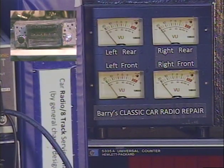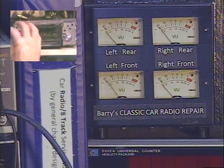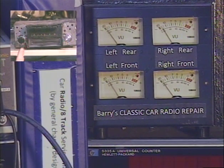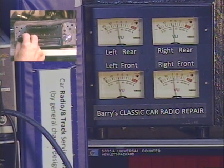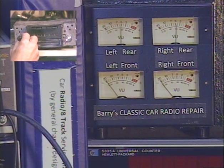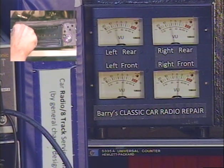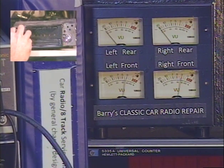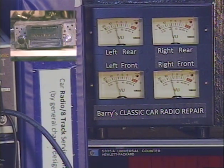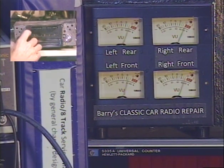There's our unit back in the upper left-hand corner. I'm going to give the tone control two turns to the right, and after that you're going to hear either a voice prompt or a set of four beeps letting you know that you can now use that same control to adjust your front-rear balance. So to adjust our fader, we give the tone control two turns to the right. There's our tones. Now this tone control is adjusting our front-rear balance — rear only, front only, rear only. I'm going to center the speakers and take my hand off the control. One beep lets us know that the setting has been saved. This is all done with just the tone control.